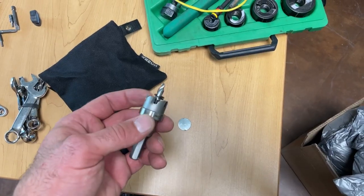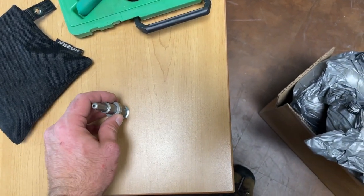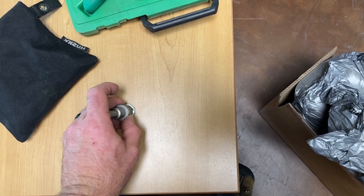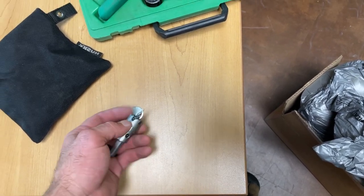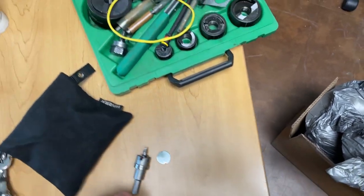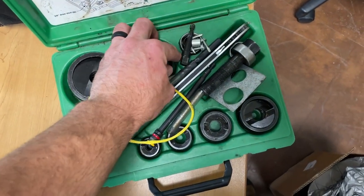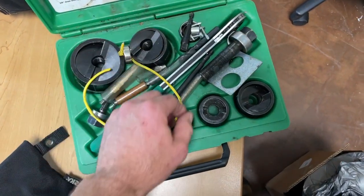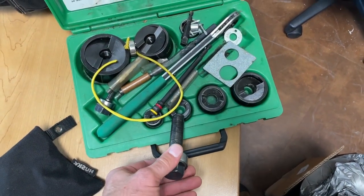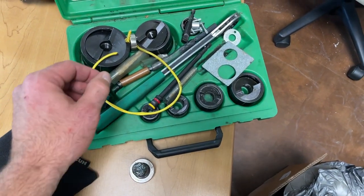To make your knockout holes, you can use a bit like this. Of course, this is half inch, you'd need 3/4, and drill into here and just hope this doesn't spin out, which normally doesn't work well, because once that breaks out, your pilot's gonna be shaking around. Knockout punch is a lot better solution. So all I'm gonna do is just stick this through the hole and use the 3/4 knockout punch. Easy peasy.